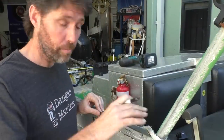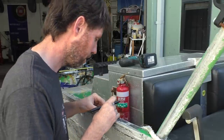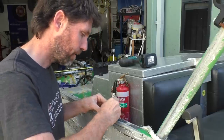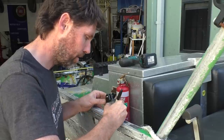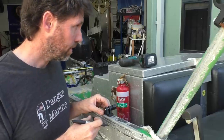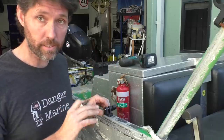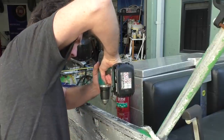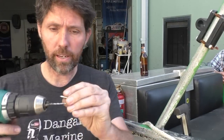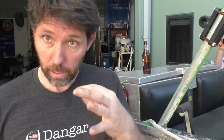I'm going to measure 300 millimeters from this upright and just mark that on the gunnel. I'll make that 300 millimeter mark the position of the aft hole and then just mark the front one. We'll do that both sides, drill it, then screw these on, and then I'll actually attach the Bimini to these so we can start playing with the forward and aft stays. The drill bit is just a bit smaller than the screw size so that the thread has some metal left to bite into.